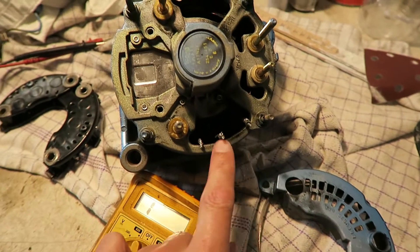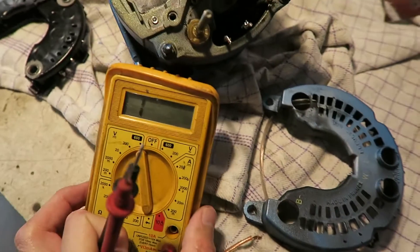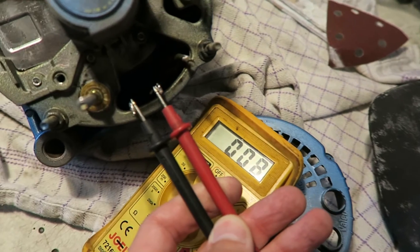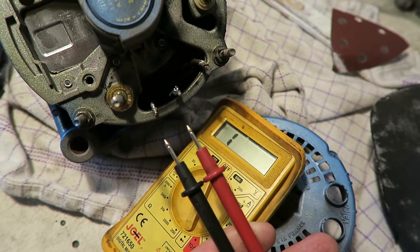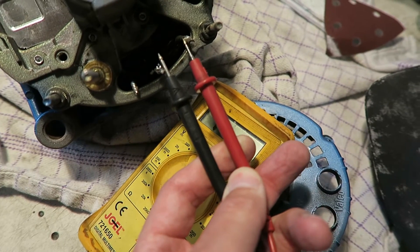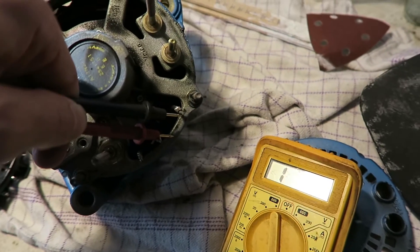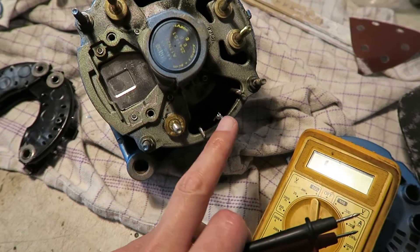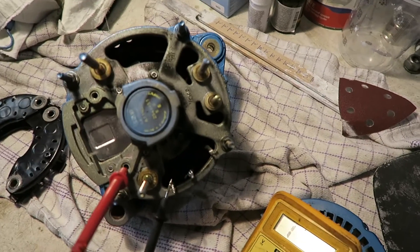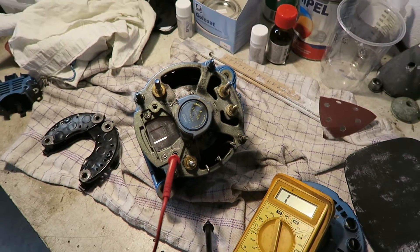You will then test the outer field winding in the generator. There are three wires here. To do that, you switch your multimeter to diode mode and look between each line — as you can see, there is a totally good connection, which means the coil is totally okay. There must also not be any ground from the coil to the body of the generator — as you can see, there is no ground, so this coil is working totally okay.